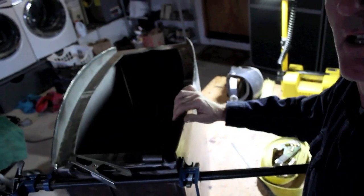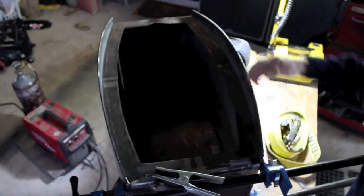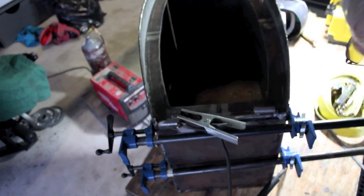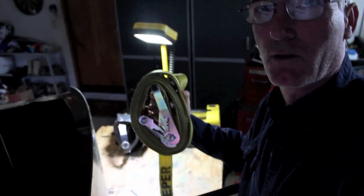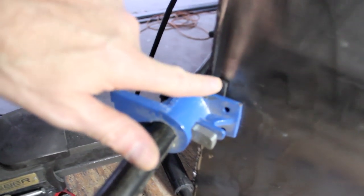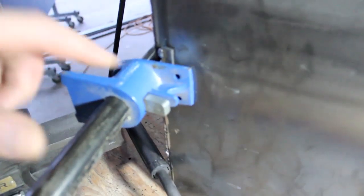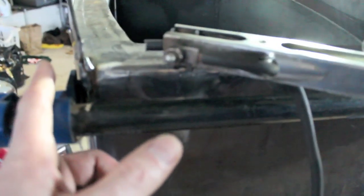One of the first things I had to do was to stretch the big sheets of metal — the 3/16th metal — across the top. You can see it's got a pretty good bow on it, probably a two-inch differential. Using a heavy duty load strap with a winch buckle, I was able to cinch it down most of the way. I welded small chunks of flat bar onto the edges of the metal so that the clamps have something to grip, and I was able to bring down the last couple of inches to get a weld into the corner so it will all hang in.